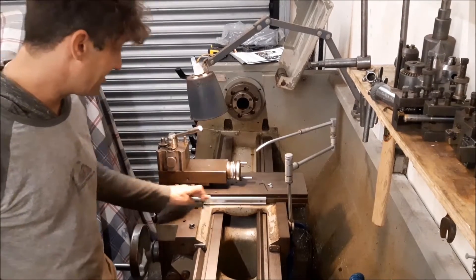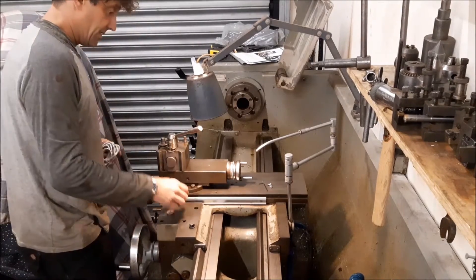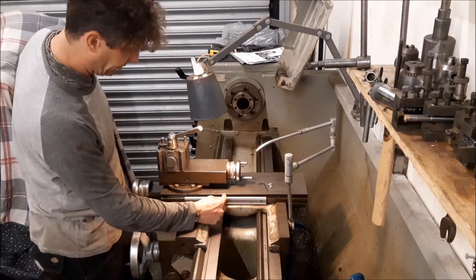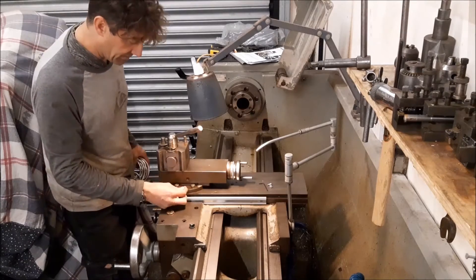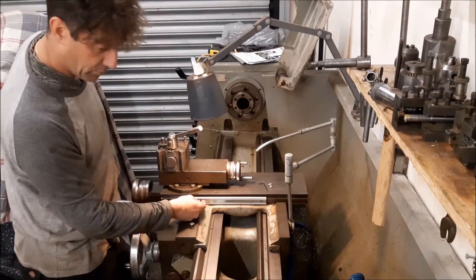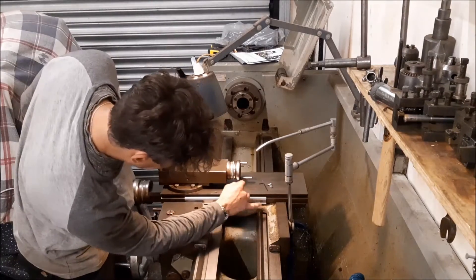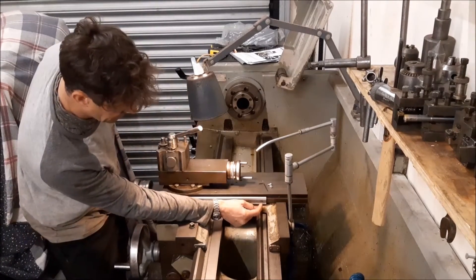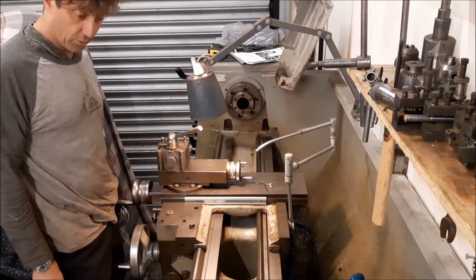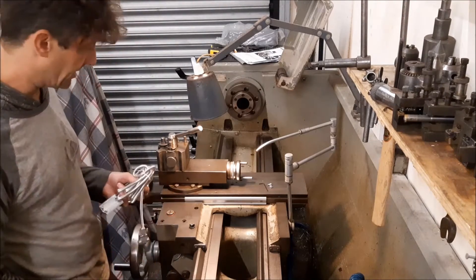The first thing to locate is this aluminium extrusion. You get this aluminium bracket. In the instructions, it shows you how to measure. It has to be into the centre of the cross slide, relative to where the compound slide is. You measure it off and pack it out with a couple of spacers — I just used three of the 4mm washers. Then you basically drill and tap three holes, M4. It's cast iron, so it drills quite easily. I just went straight in with the 3.5mm drill.